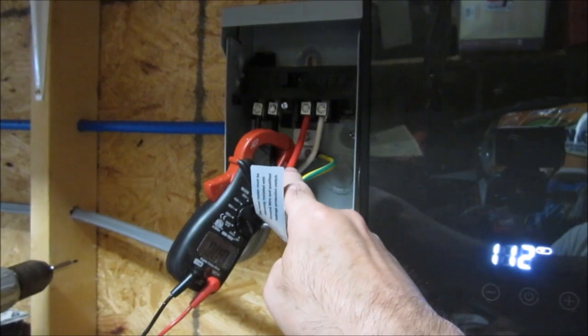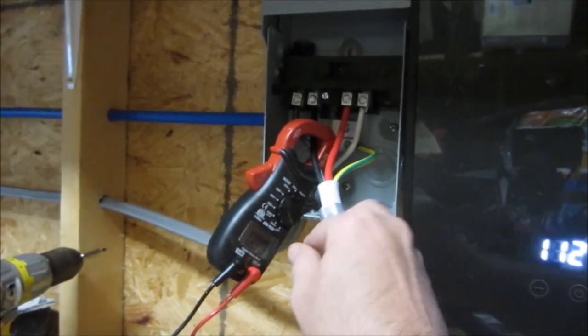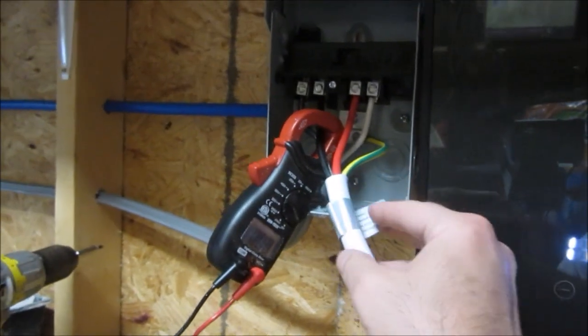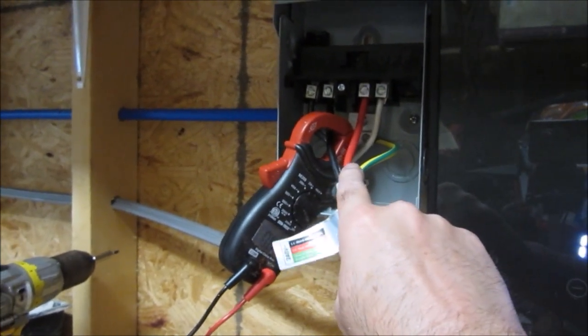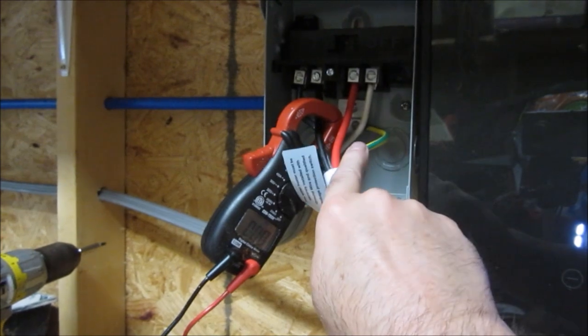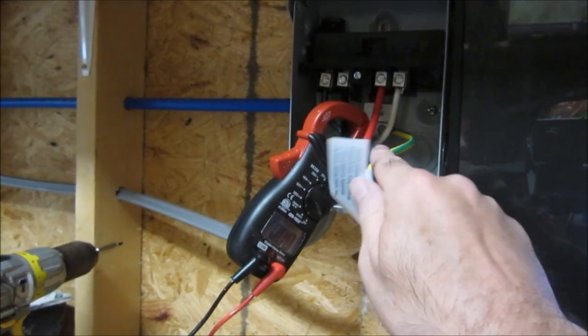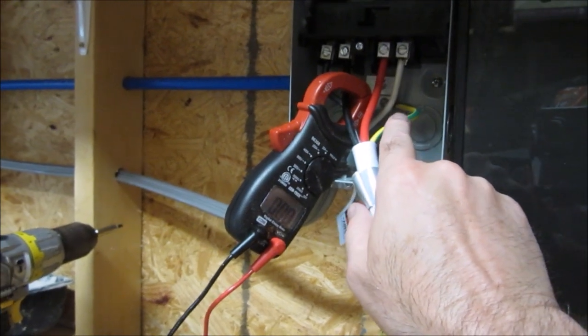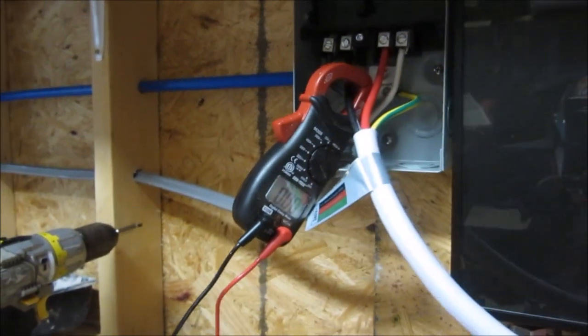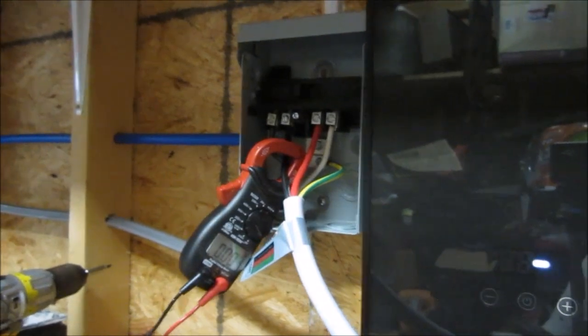Besides being really pretty, it comes with this keen pigtail that is very beefy wire. That is for sure 8 gauge wire coming from the device and going from the appliance and going into this breaker box. The ground wire is probably not 8 gauge. It's probably 10 gauge because it is a bit thinner than the other two. Not a problem there. You're just grounding the kettle.